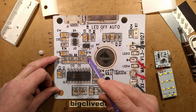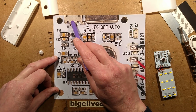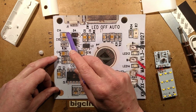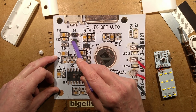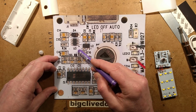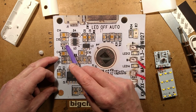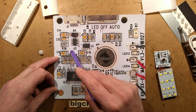Other things worthy of note. This is definitely the charge chip, and this diode here is in series with the incoming supply, which is good because it actually drops the 5-volt incoming supply down by at least 0.6 of a volt before it hits this, because this is a sort of TP4054 style regulator. It's just marked the number 17. And the only other obvious components in here, we've got a couple of capacitors for decoupling, just for noise reasons.